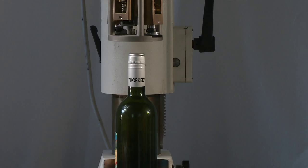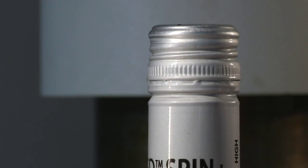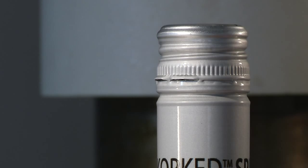Flaring of Bridges. The aluminium between the screw cap's bridges tends to deform or flange due to the following causes: the bottling head is not adjusted to the correct bottle height — check the height of the bottling head; the force applied by the bottling head is excessive — verify spring pressure; the beading under skirt is too high or too low — check the height of skirt rollers; the bottle diameter is too wide or flares before the end of the screw cap — check the glass technical form and consult the bottle's producer.